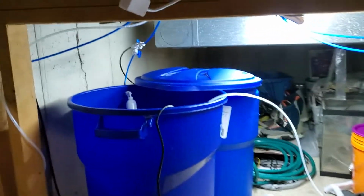Over here back at the pump, I may have to unplug it to see this, but as you can see, it just popped. See how that is very loosely on another pipe. When all the float valves close, this will pop off, and then the pump just circulates water into the container rather than putting a bunch of stress on the pump because it can't pump the water anymore.